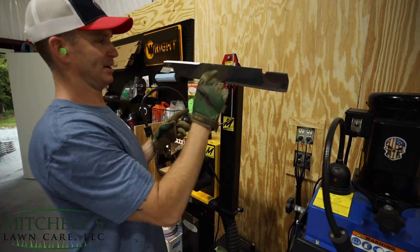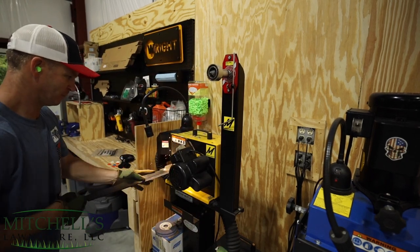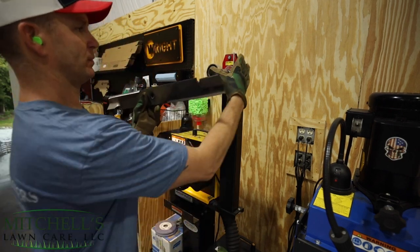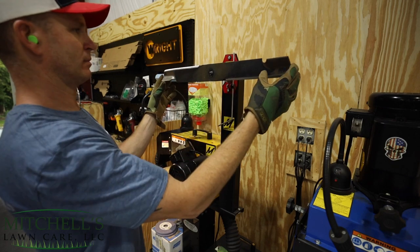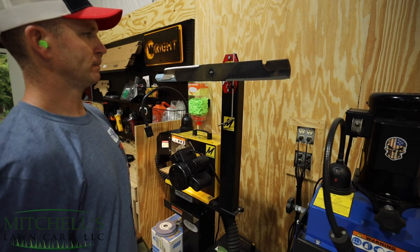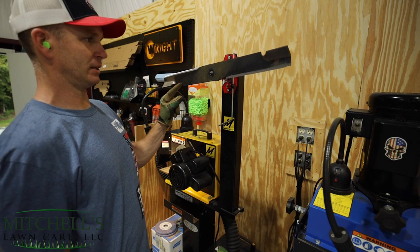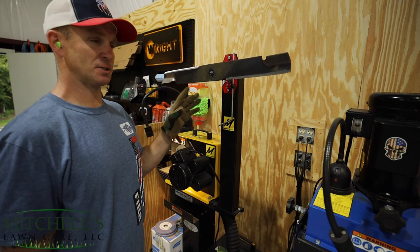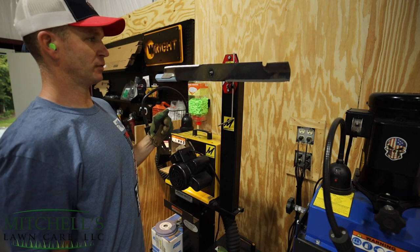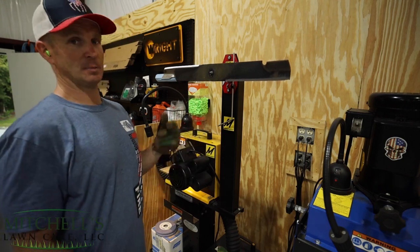So it was just a tad bit too much — I went back to the grinder. I would call that balanced. Even though it's coming down slightly, this one is balanced. And you can even get it to where it stops completely, but for the sake of the video — see, like right there — if it hangs like that for a couple seconds, it's balanced.